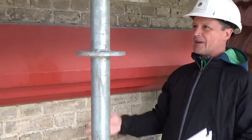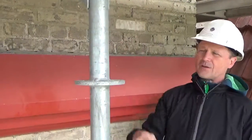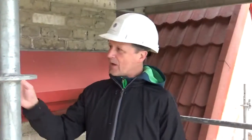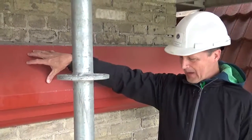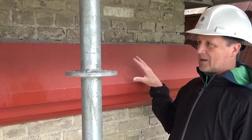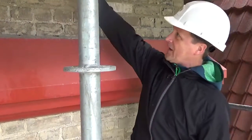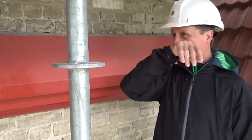I think these are about 2 foot in thickness rising up, and they may corbel back to be only 18 inches when we get to the top plate. I think those are the numbers. So there was a transition detail here. Now what may have happened, ideally it would be nice to open this up and find that there was a stone wash course here, so that any moisture on the upper shaft would come down and then be pushed off like the buttresses are trying to do.